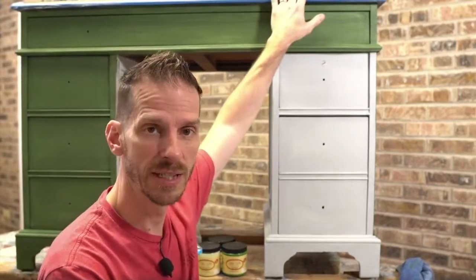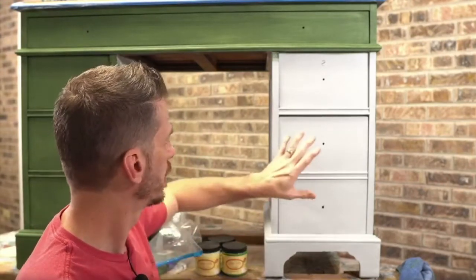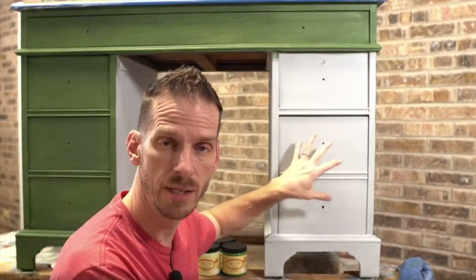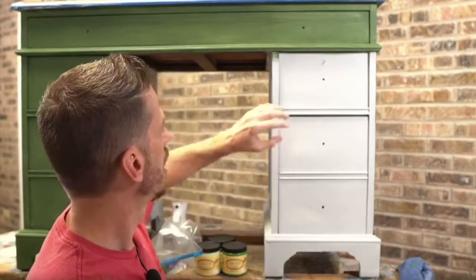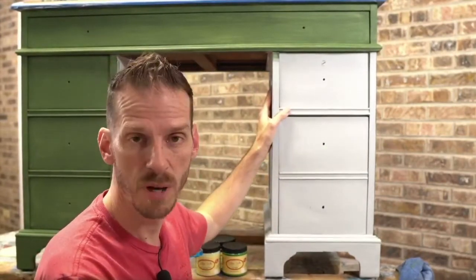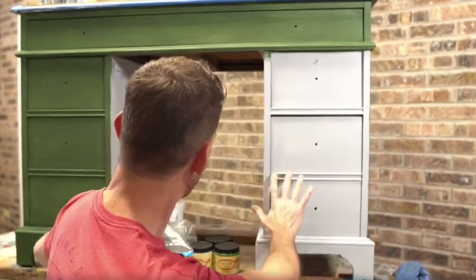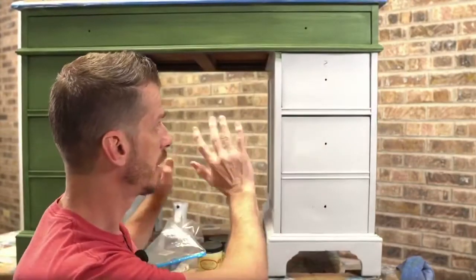This one did need a little bit of work. I did sand the top down. I'll plan on staining that probably with Voodoo Gel Stain like I've done the last couple of desks. I did a little patching here and there, cleaned it, and then used gray — Dixie Bell's Gray Boss. I've already painted part of it green just because I wanted to have some areas a little bit further along, and then I left some areas with boss just to show you the basics from taking it from boss to where we're going.